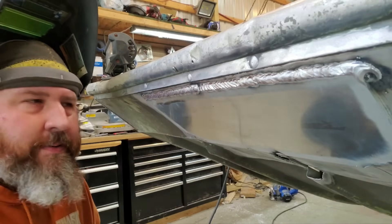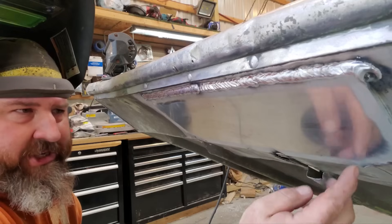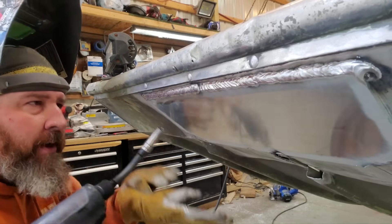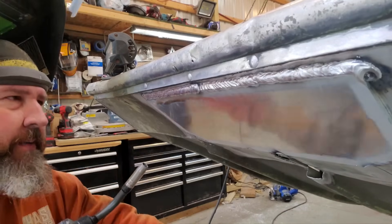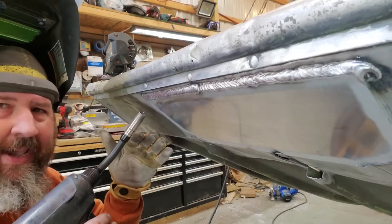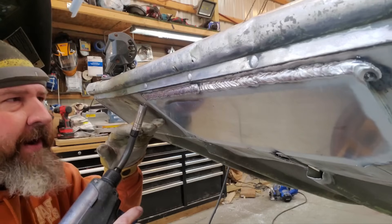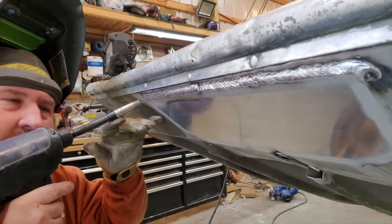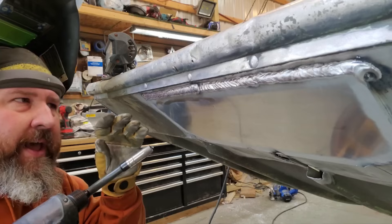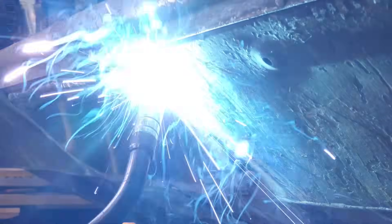The only thing left is to go down and across the bottom. I'll put my other plate on and stitch the two plates together. This bead is almost overhead so I'm running it like a 4F overhead position — coming down makes it much easier to monitor heat input and watch the back of the puddle. If I go over 90 degrees there'll be more soot; too steep a down angle and I'll have undercut. I'm going to weld at 90 degrees from the part and 45 degrees pushing into the throat where the two pieces come together.